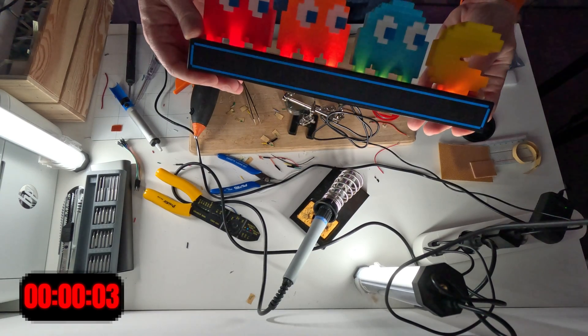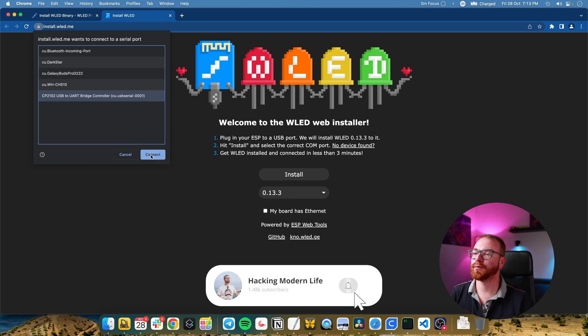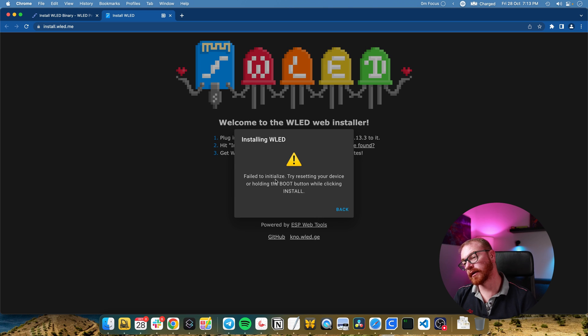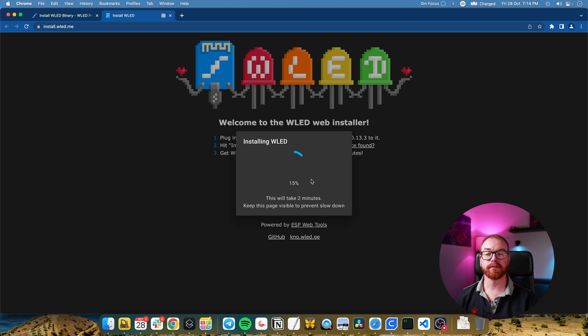I'll keep going and we'll see how long it actually takes me to get it working. I connected the hardware — I have no idea if it will work, but let's use WLED for that. It can install directly to the ESP32 from a website — that's the first time I've ever seen that work like that. Every time I see a website connecting to hardware I'm blown away. You hold the boot button while clicking install — I think it actually works. Basically using a website to install firmware to hardware connected to my USB — I had no idea the web today has that kind of control over hardware.